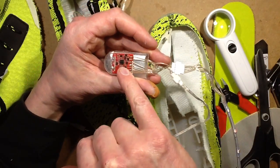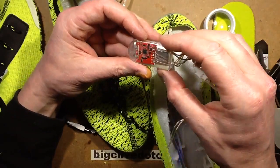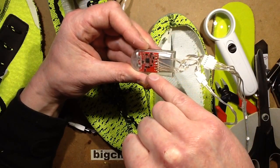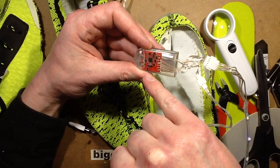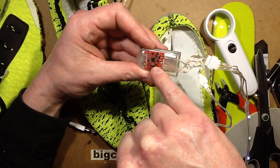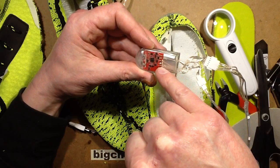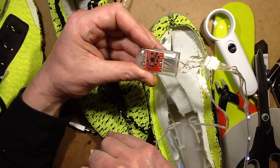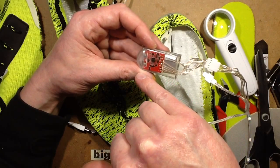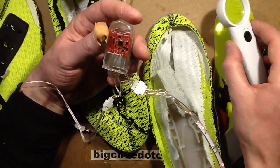And a little ubiquitous 8-pin chip, as usual. 3 of the pins will be buffered through transistors in here. And then there's the other 2 transistors. Well, let's see, that says red, blue, green there, so that must be these 3 transistors, I'm guessing. And then the other 2 commons are switched through another 2 transistors. And there's what looks like a little protection chip for the lithium cell. But I don't see the MOSFET package with it.